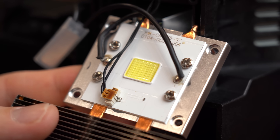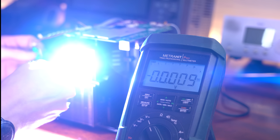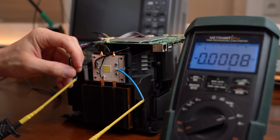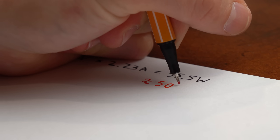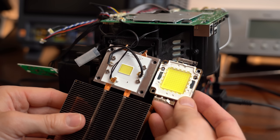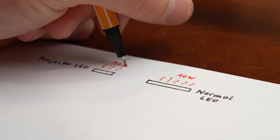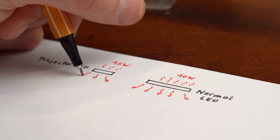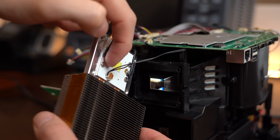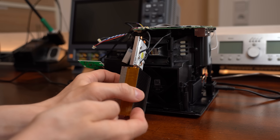I started out with the high power LED whose part number I tried researching on the internet but nothing showed up. So instead I measured its voltage while turned on as well as its current flow, and according to those values we can assume that we are dealing with a 50W high power LED. I do have such high power LEDs lying around, but what is immediately noticeable is that the size of the projector LED is much smaller in comparison. That is a problem because when both feature the same power losses, it is harder to get rid of the heat quickly from the smaller LED. But replacing it is also not easily possible because its optics are made for this size, so we cannot do much about the LED.